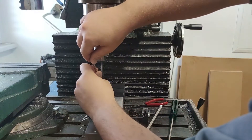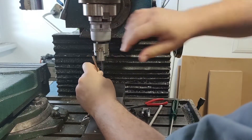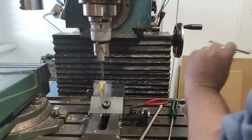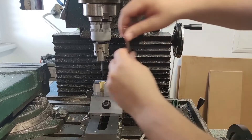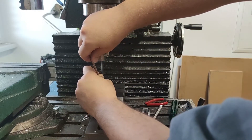For precise bore measurements I used a snap gauge with multiple measurements for higher precision. A 3-point micrometer would be better of course, but I don't have it yet. Stefan Gotteswinter made a great video about measuring with snap gauges, their repeatability and precision — link in the description.